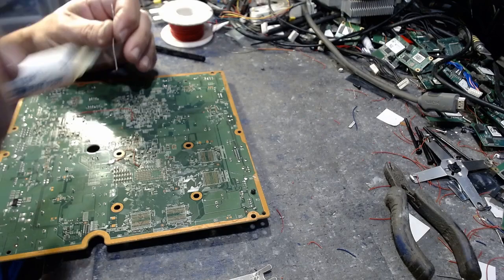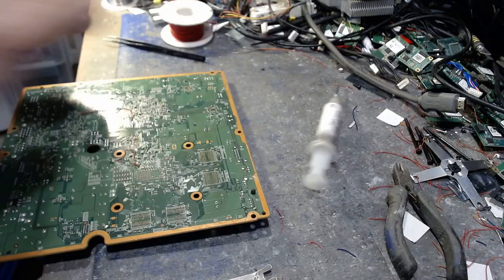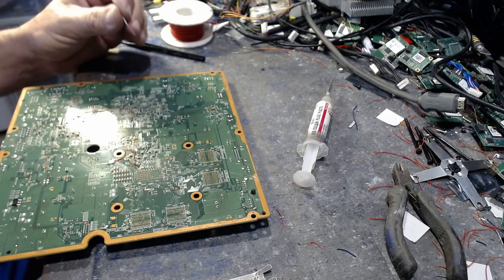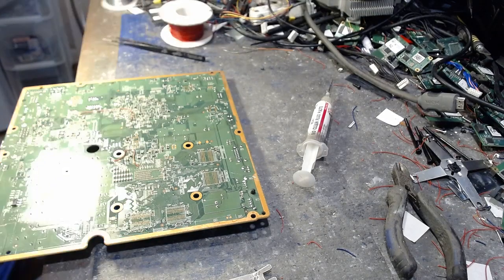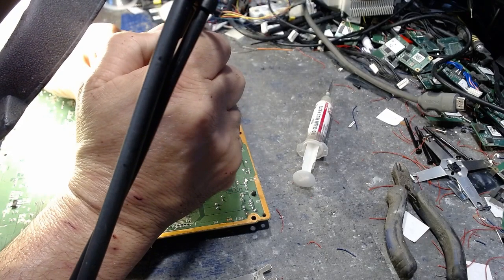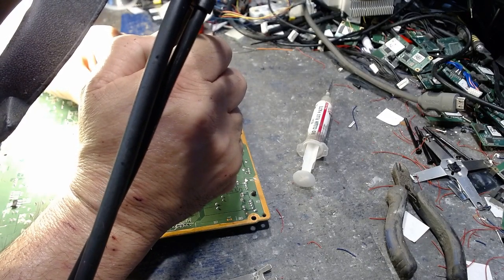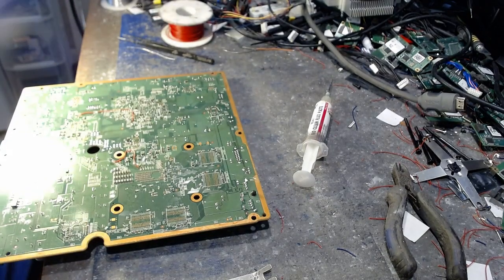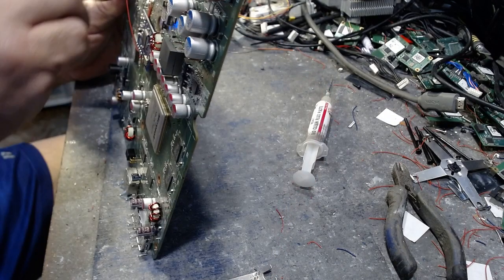we're going to flux the RST cable point right here. Okay. Now, all right. Let's see here now. Here we go. Make a nice little solder ball on there. Pretty much the same points, except you're just adding a point. That's all you're doing, which is the PLL.